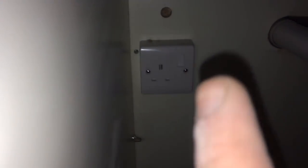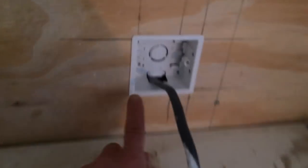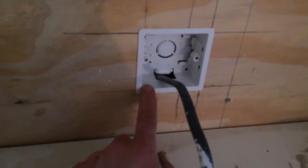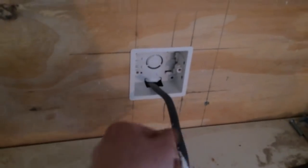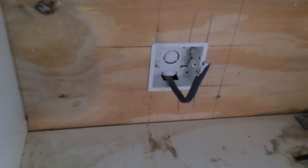You don't have to have a flex outlet on this one - you can leave this because it's accessible. If the fuse does blow in the plug you can get to it because it is under the sink. I've had to cut and refix a new box in here because the kitchen got brought out 2 inches. It was chased in and flushed in but now we've fitted this and I want to fix my flex outlet to that.